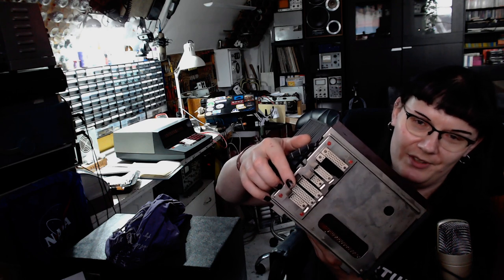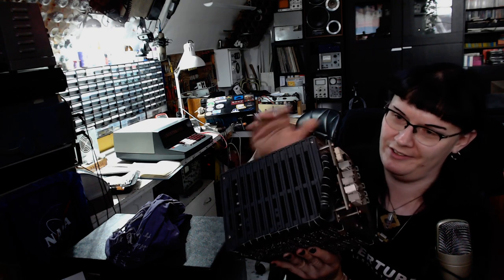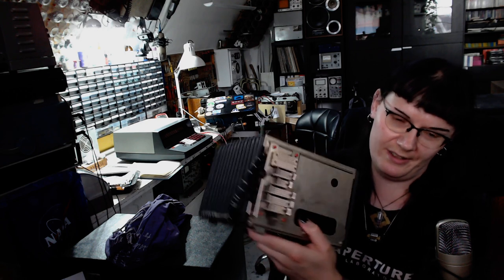You just have to take care not to jumble those connectors, because those two are identical. The first one are identical as well, and the big black plug on the second connector, it's just a jumper block. Removing it cuts off the clock generator, because the test fixture had its own clock generator, and it also allowed to manually advance the counters in the calculator for diagnostic purposes.